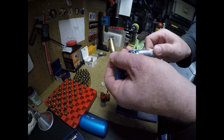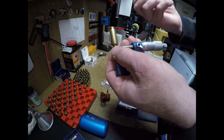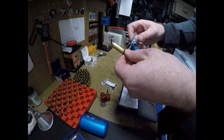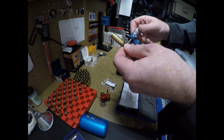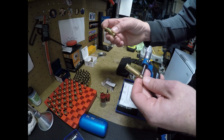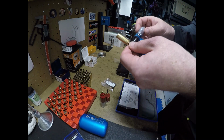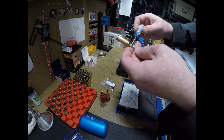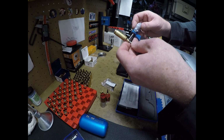The ball and this little flat area here line up perfectly onto a cylindrical surface. So this ball micrometer is perfect for something like a rounded area, like measuring the round interior of a piece of brass and the thickness of the neck wall. What you do is turn them, and you have to practice quite a bit, because it's not easy to get used to this thing.